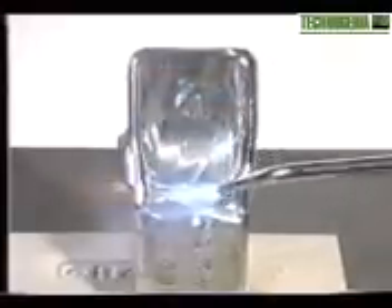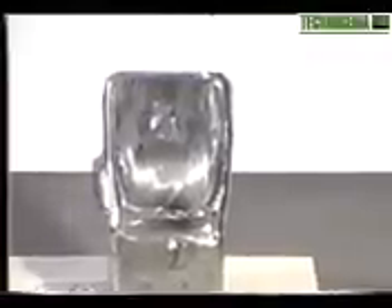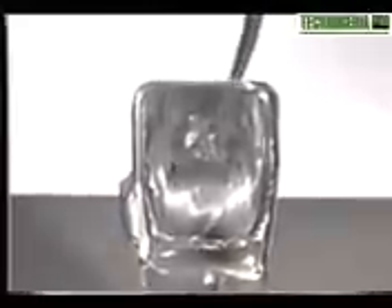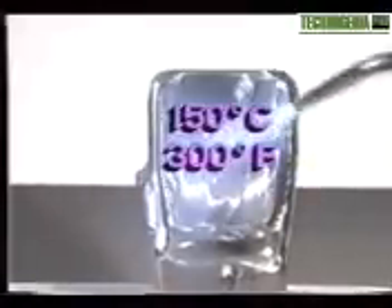After clearing, orient the piece on the jig to give the maximum access to the surfaces to be powdered. Before spraying, the piece must be preheated at 300 degrees Fahrenheit.